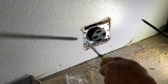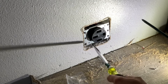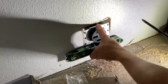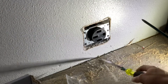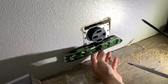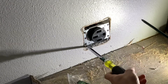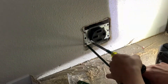It's going to be sitting on the sheetrock or on the box, so I try to have it all the same so it's level. Luckily mine's sitting on the box so I won't have a problem. You can kind of level it out or eyeball it. Right now I can see it's not level but you can kind of eyeball it with the floor on the bottom. I already know it's going to have to go up a little bit, so if you can put a level on the edge of the metal that helps out. If not, just eyeball it.